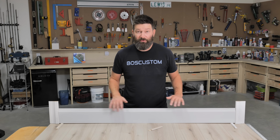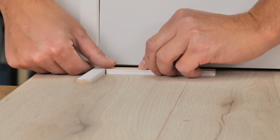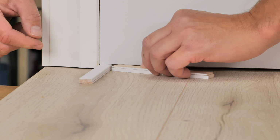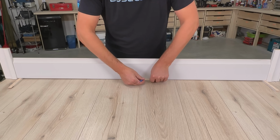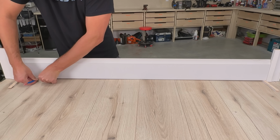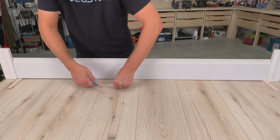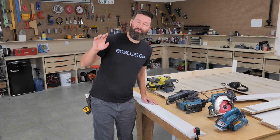And yeah, now you can see this is not wiggling, it's hitting on the hump. And then take that same combination of shim, it worked out to be a 1/4 inch, and then go ahead and trace on that scribe line. It's going to be easiest to start this one in the middle, work to the right as it fades into nothing, come back to the middle, work to the left as it fades into nothing. Now let's put this hay in the barn.